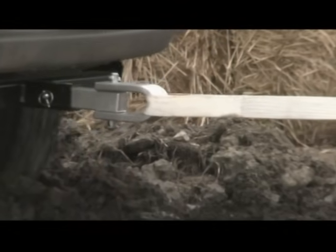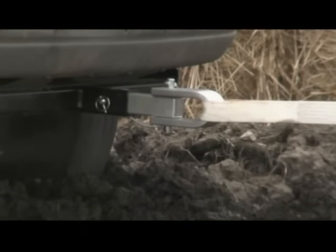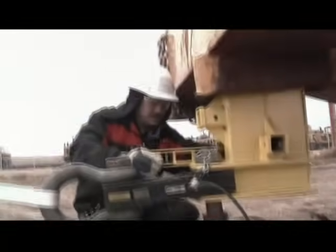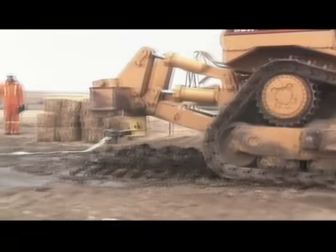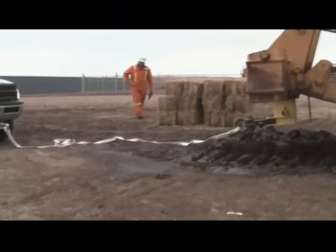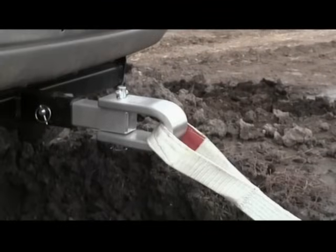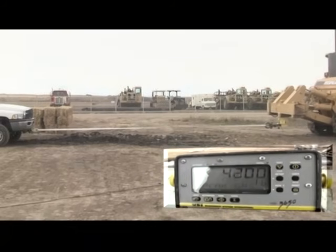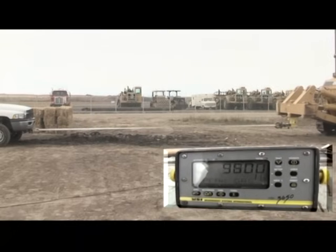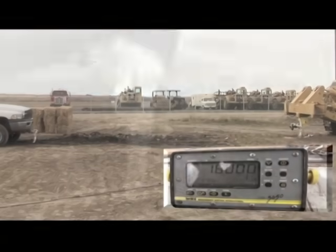Previous tests have indicated that the 2-inch untreated white straps are capable of withstanding tows of up to 19,000 pounds. But today's demonstration clearly shows that the untreated straps will fail between a minimum of 16,000 and 19,000 pounds. To emphasize this point, we employ the power of the D8 Caterpillar and slowly inch forward to measure the 2-inch strap's exact breaking point — true to the untreated strap specifications, it snaps at exactly 16,000 pounds. Again, no deadly flying parts, just frayed material and a successful measurement of tow strength.